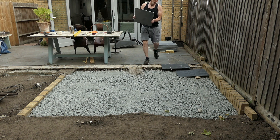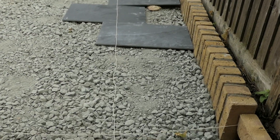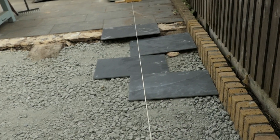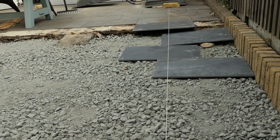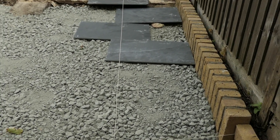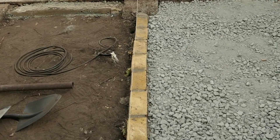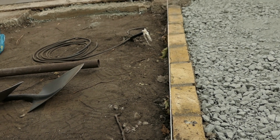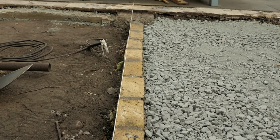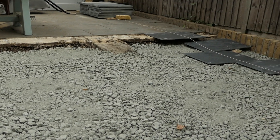I'm laying some of these out to get an idea of where they should go. I'll have to cut some of the slate tiles that go up against the retaining wall I've built. I will make sure I follow the exact line of the tiles that are in place on the existing patio area. I'm going to use this side here as my line to follow. I've laid out a string line so I know exactly the line I need to follow, and I'll work from here all the way across to the retaining wall row by row.